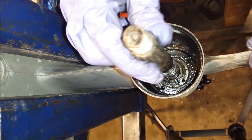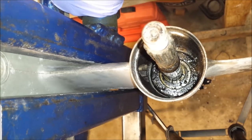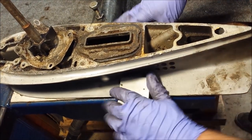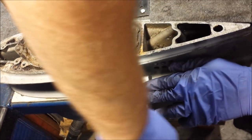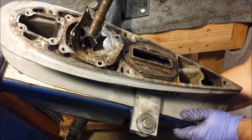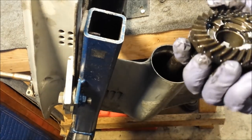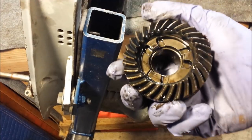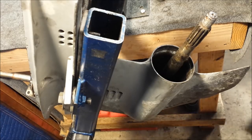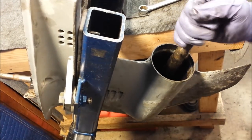Now there's the reverse gear and that little lock ring. We're going to use the twist-and-jiggle method to get it out of there. A lot of clamps came loose, so let's tighten down a little bit more. It's a little thrust ring washer thing, and the reverse gear fell out. Looks like we've got no real clutch dog wear damage or any teeth issues, so the gear should be salvageable. Now we're going to have the fun part of getting the prop nut off.